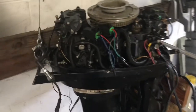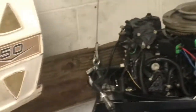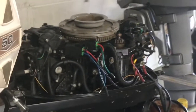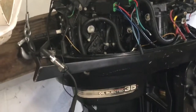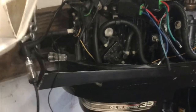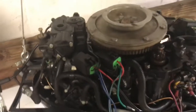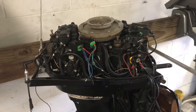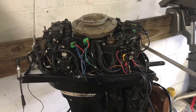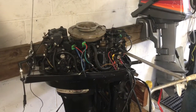I'm going to check spark. I've got the wires hooked up and the spark testers are hooked up. I can see spark on both cylinders — we've got good spark. So I'm going to leave it there for today. I've got spark, I've got good compression, I've got a decent starter on there now. I just have to try out the tilt-trim motor to see if that's functioning, and then this motor hopefully will be ready to barrel test.